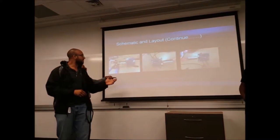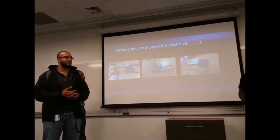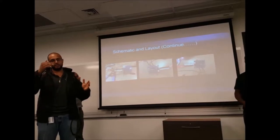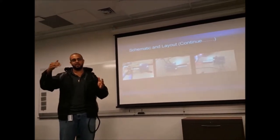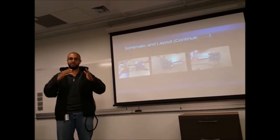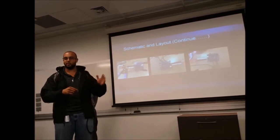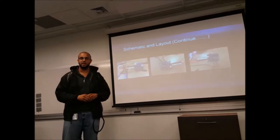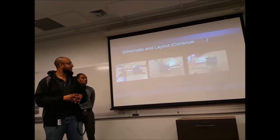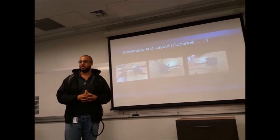This is one we were programming. During programming, we ran into some serious issues with the position sensor. We did a case, a nested if statement, but it would never fall where it needed to. Some of the values were conflicting, and it would trigger the wrong position, or it would just not switch the way it was supposed to. So later on, we figured out that our if statements weren't correctly implemented.